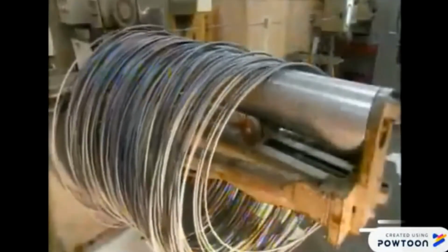The job of making screwdrivers starts with coils of specially formulated steel. Wheels straighten the thick wire, and then it travels through an aperture. On the other side, a machine rocks back and forth as it cuts the wire to length and forces it through 4 dies. The first die narrows the steel to the required diameter. The others form a hexagonal bolster partway down. This bolster will allow a wrench to be applied to the screwdriver to increase its turning power.